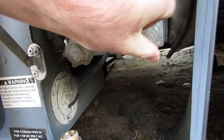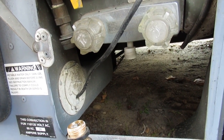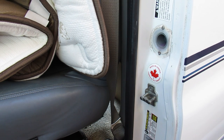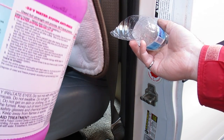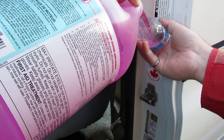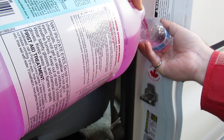Now I'm going to try to put the two gallons of antifreeze in the tank. This is potable water, so you can't use just any funnel you've got sitting around — don't want oil on it, don't want it to be dirty in any way. Use a water bottle with the end cut off on an angle, stick it in the hole. It's not 100% catching everything but it's still better than nothing — you could stick some paper towel around the bottle if you wanted to get it all in there.